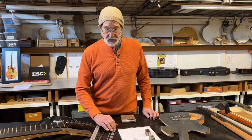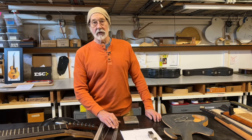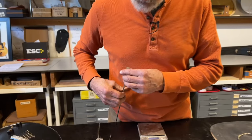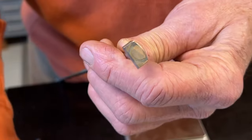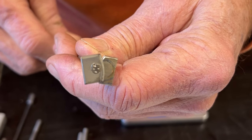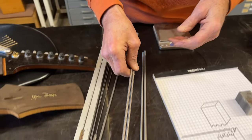But there are some prices you pay for working with titanium. For example, it does not braze, and it needs special conditions to be welded. Without special training and special equipment, you can't stick it together with heat, which means you need mechanical means to keep things from coming off. This one I had welded, and then here's one where I just hit it with a punch a bunch of times to try to mechanically lock the thread into the dead end of the truss rod.